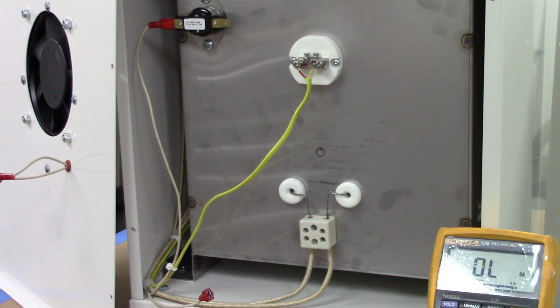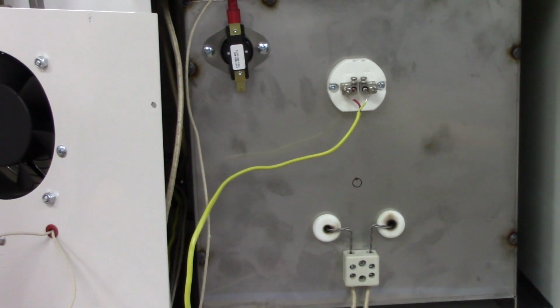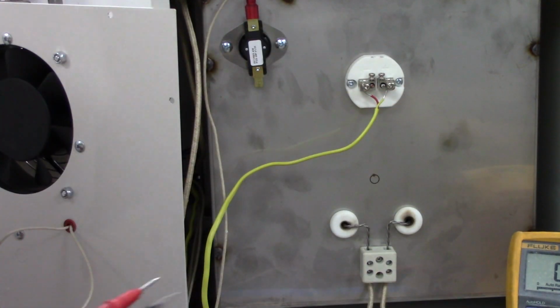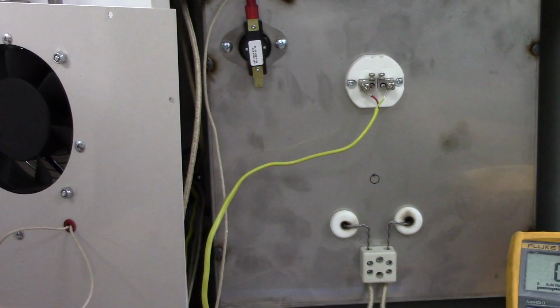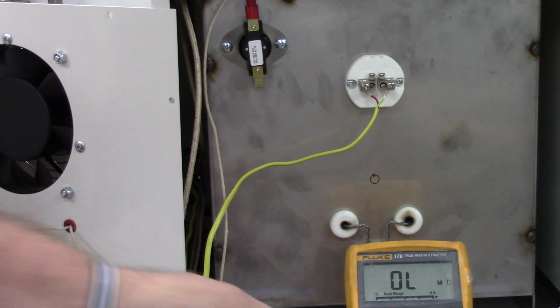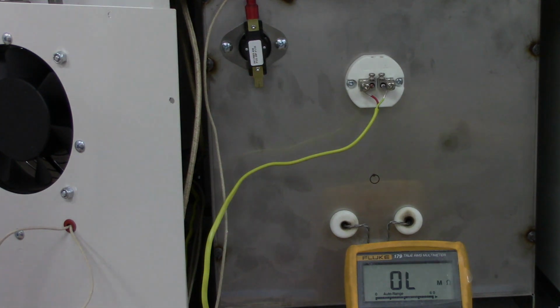Let's check the older one. This is the 120 volt hot shot, and you should be sitting at 7.5, 8, something like that. Doing that from memory. Yep, 7.6 is your resistance on that one. So two very, very different coils have to go in these things. It's not linear as far as the ohms go, as far as the resistance goes on the coil.